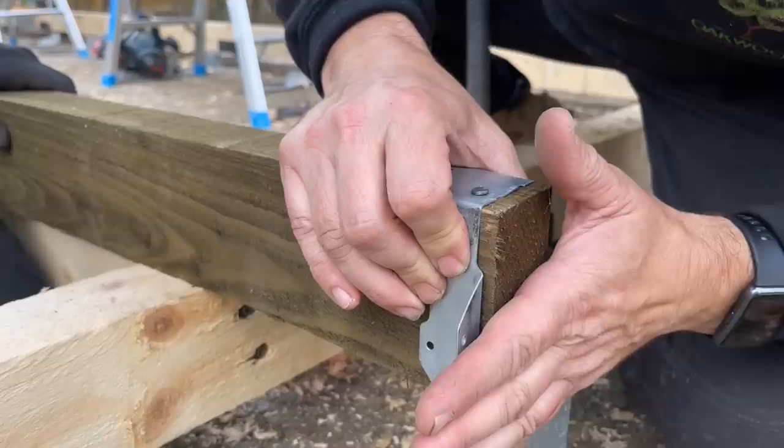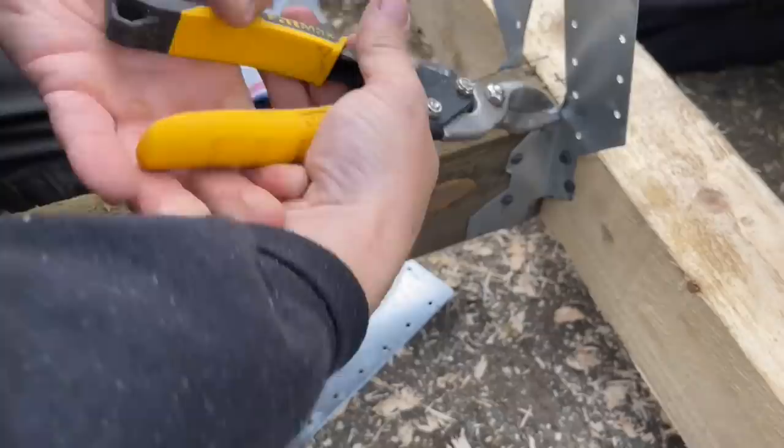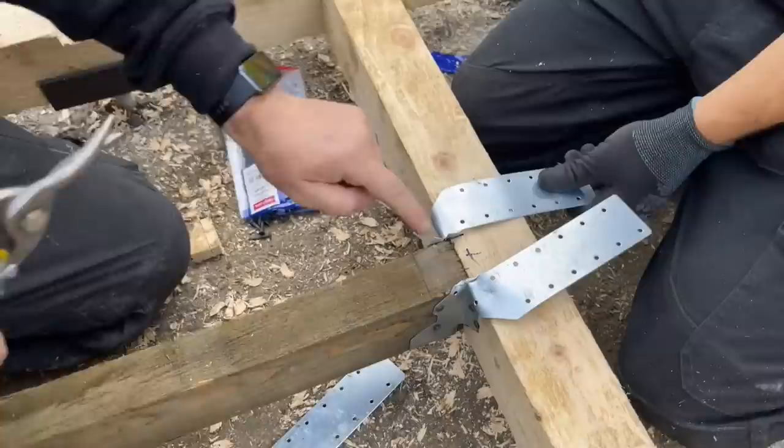So what I'm going to do now is chop this joist hanger here, and I don't know if Liam will leave the bit on where Josh has just tried to bend it and it didn't work. If we give that a nip, you can use the grinder. And then what happens is it bends over. Just give it a tap now, Josh. No, you've got to go like this up. You've got to hit it that way, then that way, and then bang that over that way.